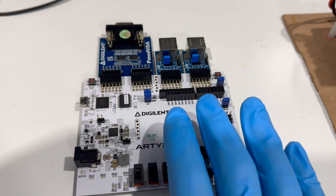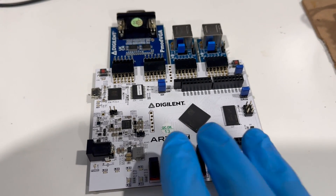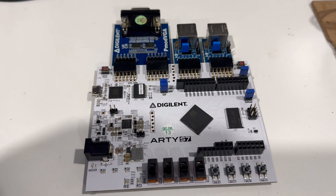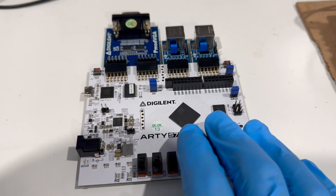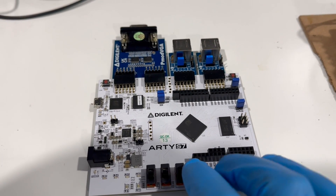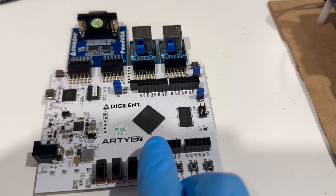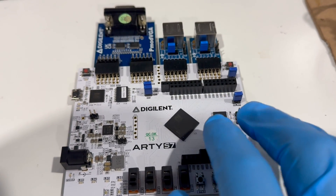Then I'm going to add a secondary floppy disk interface and then finally IDE for a hard drive. Right now I'm working mostly on the software development side of things, moving from ISE to Vivado and making sure that constraints are right and I have all the requirements in place. I'm also experimenting with MicroBlaze and all the options to replace the old ARM controller with something that's modern and more cost effective.